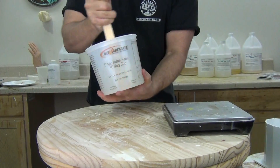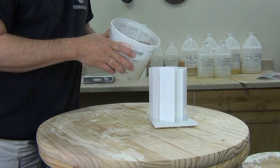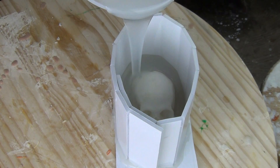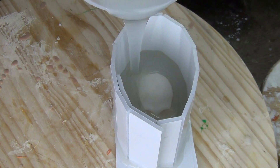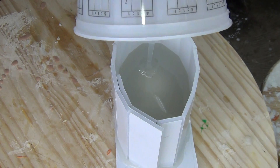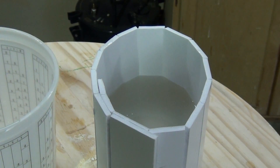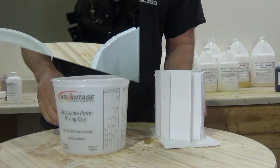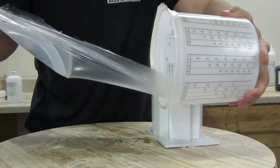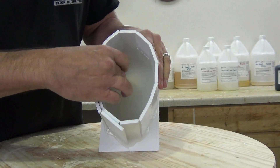Because this is a low viscosity silicone there are applications where you could get away with pouring it without vacuum degassing, but it's always a good idea in mold making — especially if you're going to be pressure casting — to vacuum degas your silicone before you pour a mold. Because this silicone has a fairly long working time considering how fast the demold time is, there is more than enough time to get everything properly mixed, poured, and vacuum degassed. Remember, before you start opening your mold box, check what's left over in your mixing cup to make sure everything is properly cured — that way you don't mess up an otherwise perfect mold by demolding too early.